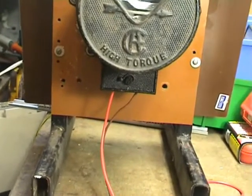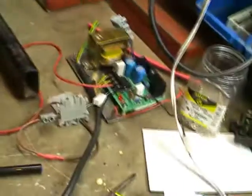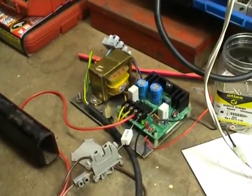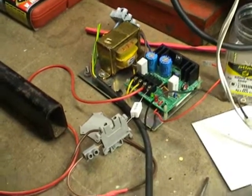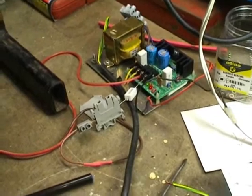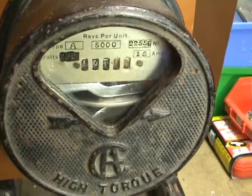The red wire is going in and the brown wire is going out. At the moment I'm using a power supply at 12 volts, with 180 ohms and 470 ohms in series just to give it a ballast. The current is about 50 milliamps to get the disc going at a reasonable speed without burning out the movement.